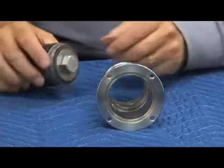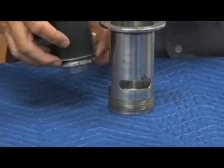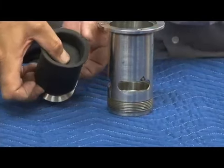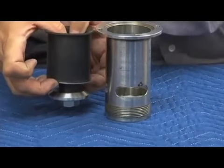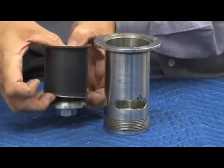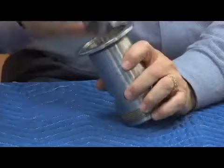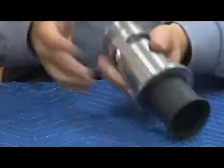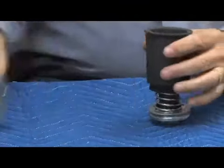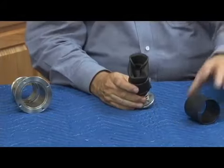So that washer sits at that secondary slot right here, holds that relief valve here, and as it goes to close, as the high pressure line comes in, causes the stem to move down, my diaphragm rolls like that. When the relief valve has to open, it pulls up. Again, the rolling diaphragm rolls up. So that's the action of that washer, is my guide as it moves up and down like that. Okay? So, rebuilding it. As I said, we're going to take the stem, comes out in one piece. Again, we had this gingerly pulled out. As we pulled it out, fold our rolling diaphragm inside.